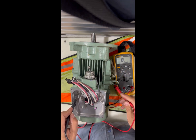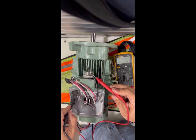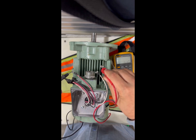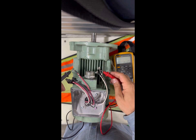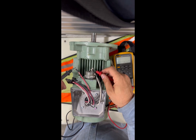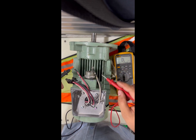Checking the ground connection — I'm looking for anything with a conductive connection, not paint, since paint is not conductive. Now checking phase-to-phase — I should read 15.6 or 15-point-something ohms. The reading is jumping because I don't have a good connection. Once I find a good connection I'll get 15 and some ohms. We checked it earlier with the mega and were reading 15.7 ohms — this should be the same. Got it: 15.7, 15.6 ohms. Good.